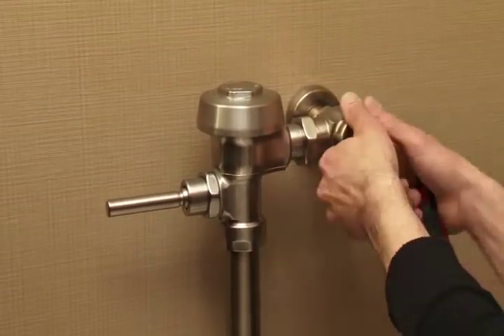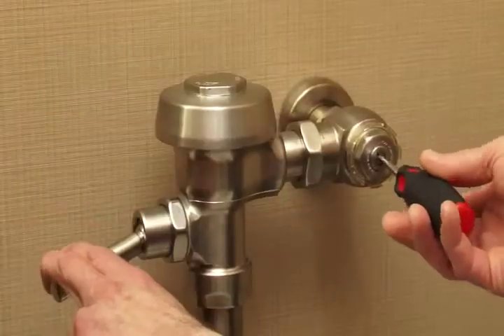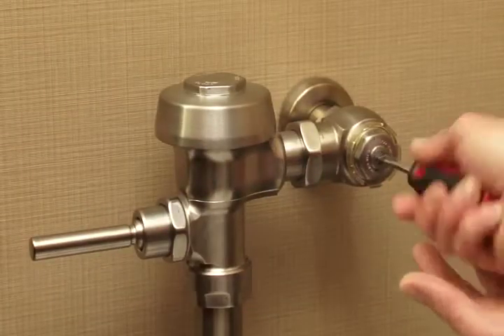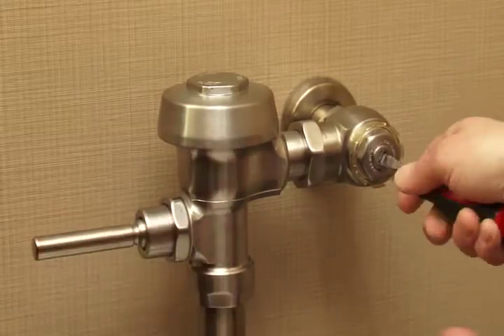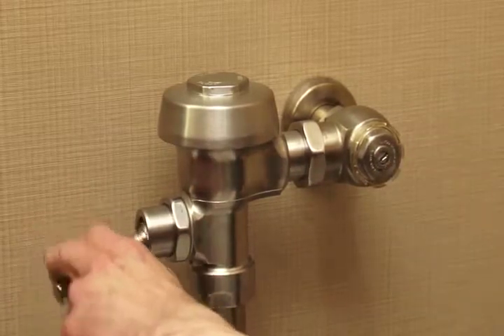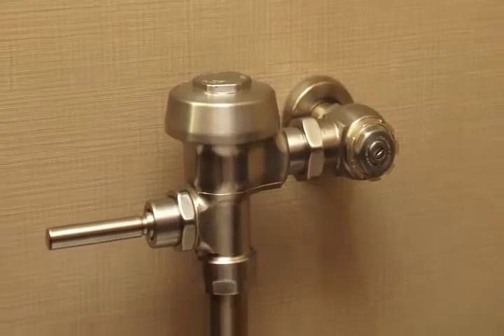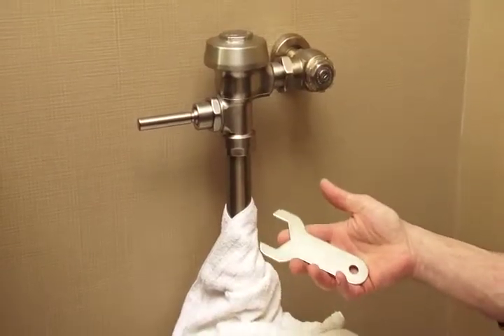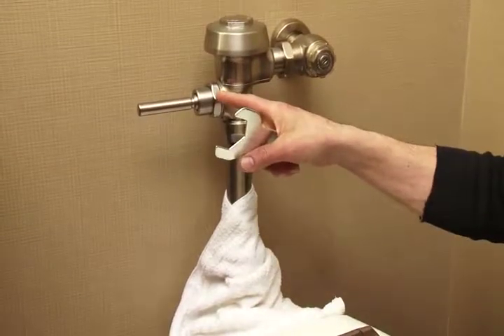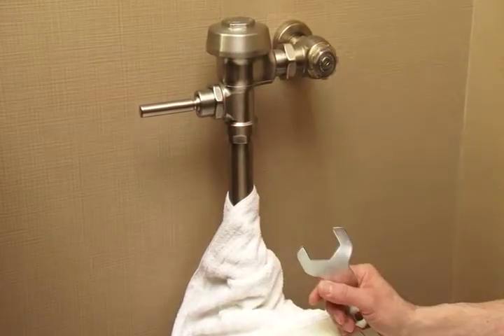Remove the spinning cover with a flathead screwdriver and turn the screw while flushing. Then flush again. Keep pushing the handle until you don't hear anything — that helps make sure there's no buildup pressure in the valve. Included in the box is a simple wrench to remove the handle coupling and replace it with the side mount kit. Keep the wrench for future use.